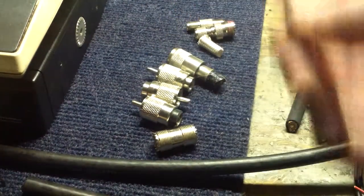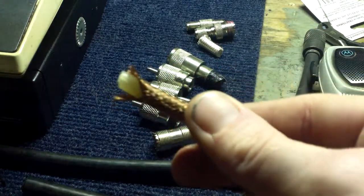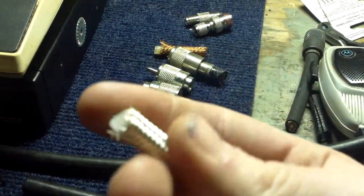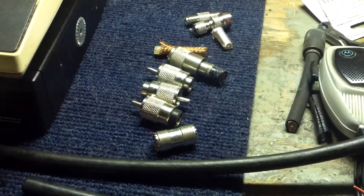So there you have it — just to recap: that's RG-213 versus RG-214 C-17D, much better, very nice stuff. Like I said, I would be using BNC or N connectors for all this cabling in a duplex environment, but because the equipment is older and uses UHF connectors, I'm going to make my cables with UHF connectors. I won't be using the best connectors in the world, but I won't have any adapters, which I think will help. Hope you enjoyed this quick video showing the differences.